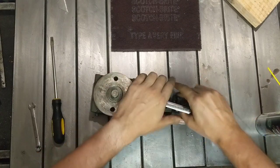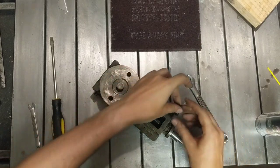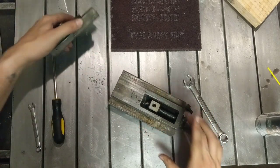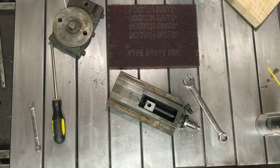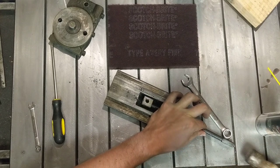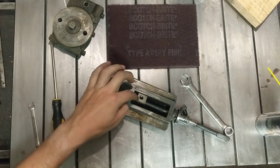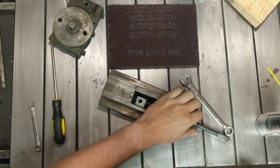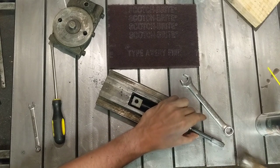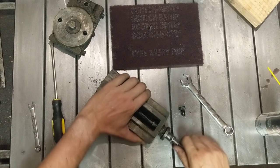Start by taking out the acme nut. Should actually free this right off. Okay. That part's done. What I'm doing is driving this bearing out to the end of its woodruff key and just seeing if that'll push out that key. That's how that worked. Okay.